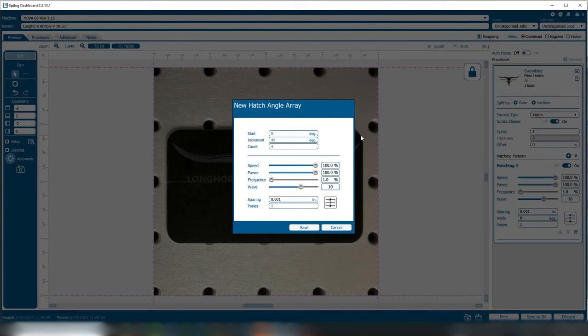Back at the laser, we can see that the job we just generated is now populated in the display panel and we're ready to run. The generate array we're going to test is on some stainless steel. You'll notice I put some fixturing posts in here — these are little posts that thread into the table, really handy for fixturing up certain types of jobs. We include some of these with the machine. Here you can see the trace on for that job showing where the image will be produced. With our job in place and liking the location, we are ready to go.